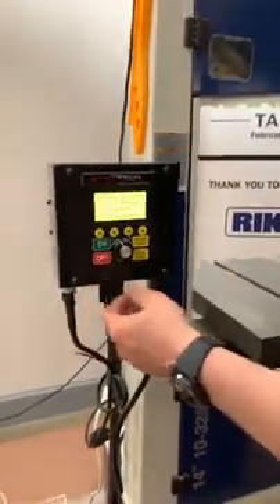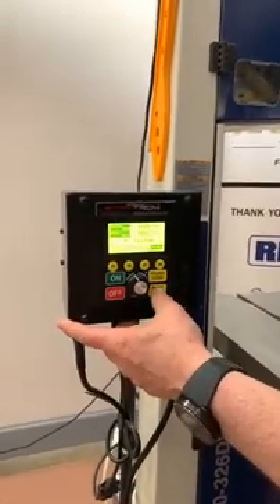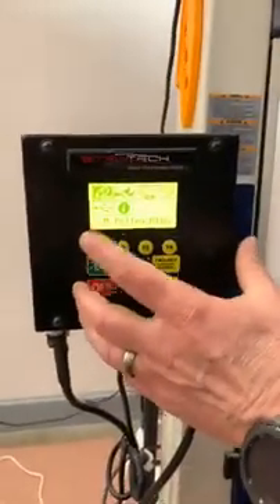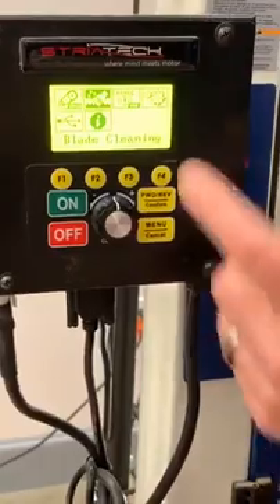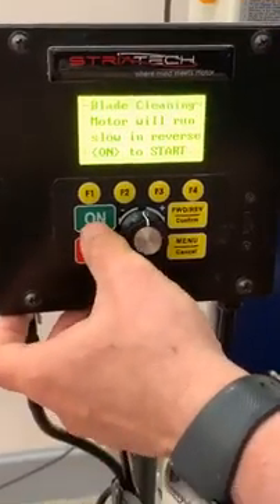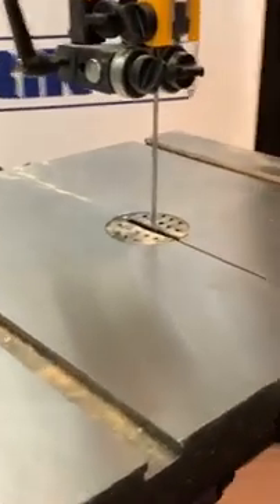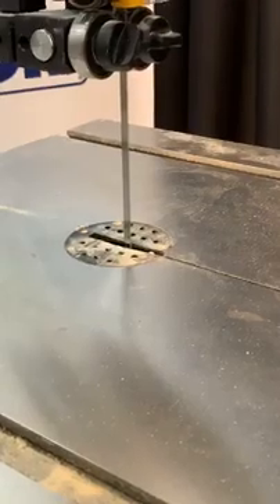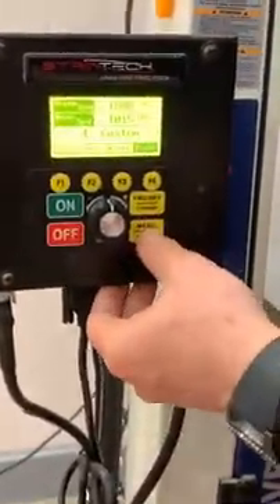In the menu part of the control box, there's a full feature screen. The first section tells us the pulley position. The second icon is for blade cleaning — when activated, the bandsaw blade spins backwards, taking off all the debris on the wheels and providing a better cleaning of the debris off your tires on the bandsaw. When you turn it off, it always resets and goes back into forward mode.